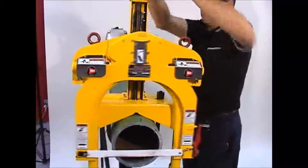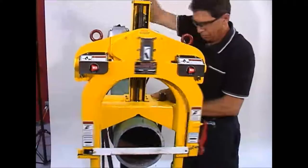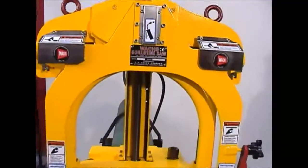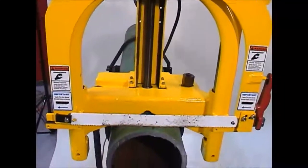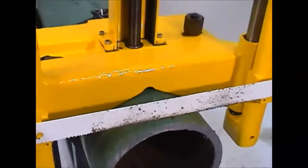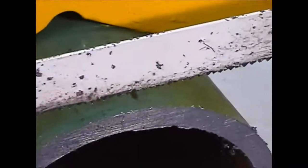We recommend the use of cutting oil on the blade when cutting steel pipe. It is good practice to drive wedges into the saw cut to prevent the blade from binding. We also recommend that you shim up the pipe to hold it in alignment while cutting. If the cut closes due to ground pressure, remove the blade and move the saw over about a half inch and make a second cut. You can proceed to knock out the ring that you cut, leaving more space for the saw to work. A cleaner, faster cut will be the result.